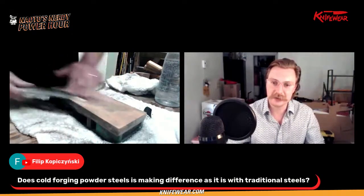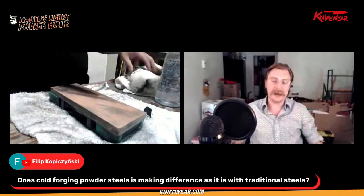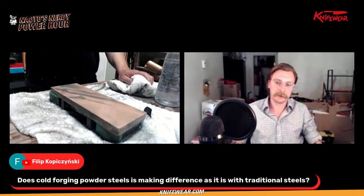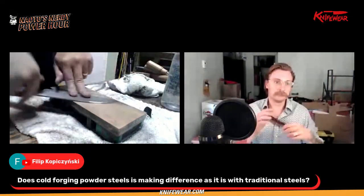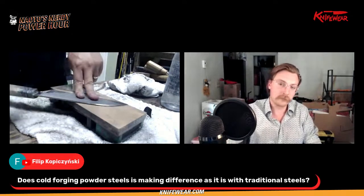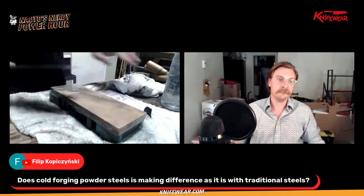Yeah, that's interesting. I know you said, or maybe Kevin said, that with the Moritaka Ishime, the line we get that has the hammering done after the steel's forged, that does have a real effect on the performance of the knife, right? Yeah, it gives you that tension. Masashi-san calls it tension. Even very low carbon steel, when it's forged and hammered properly and given proper heat treatment and enough hammering, gets enough tension.